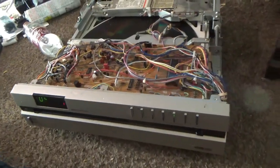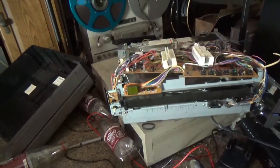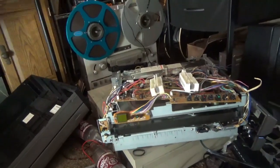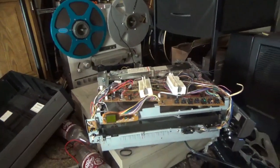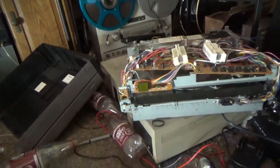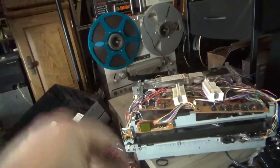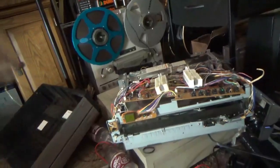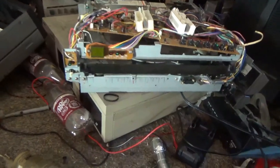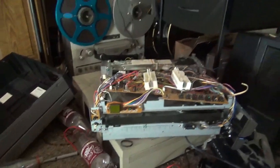So, finally got one of these to work. I don't know if I should just toss the other one, or reorder the parts and put them in it — but in order to figure out why the stylus isn't working would require some test equipment I don't have, like a signal tracer or oscilloscope. I'd need to trace components to see: am I getting a signal here? Is this putting out a voltage? I don't have those types of sophisticated tools, so I'll decide what to do with this one.